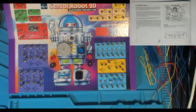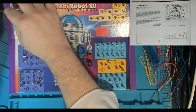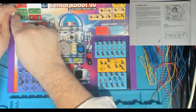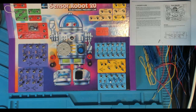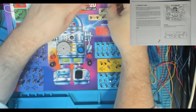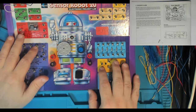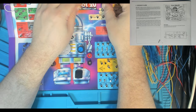Let's throw over here and we'll wire this together. Here we go — one to three, wiring in the positive power supply to the control switch — that's a pretty common start. Still getting the hang of these new wires, they're quite different to what we were using before. Then we've got 2 to 14 — that's taking the negative power over to the CDS cell, which is the light-sensitive component. And then 14 to 34 — another blue wire by the looks of it.